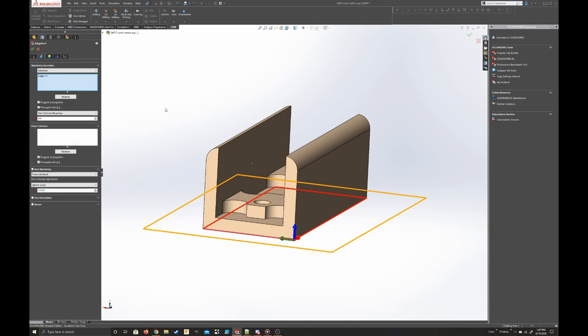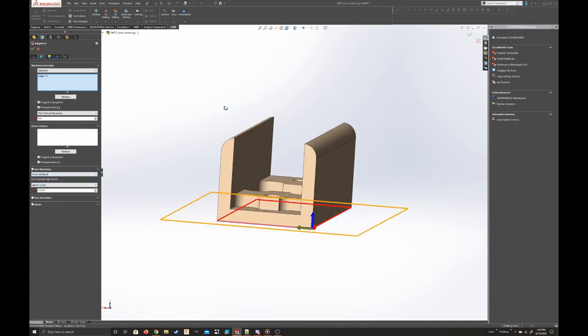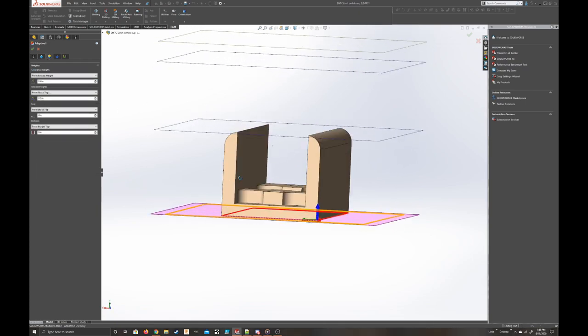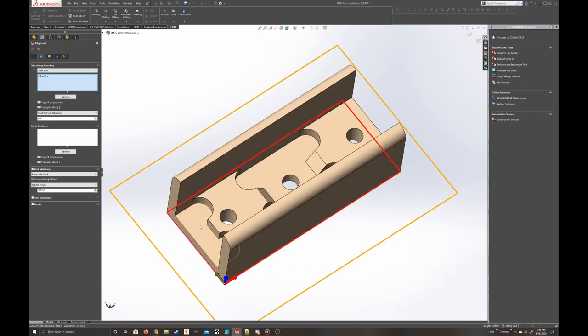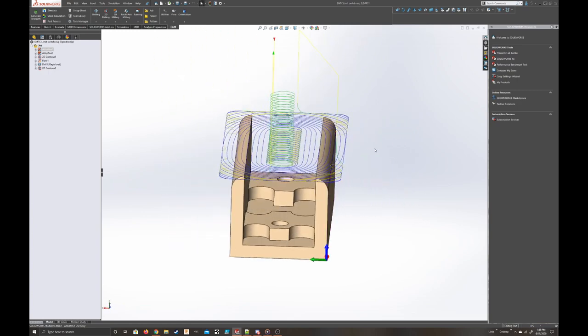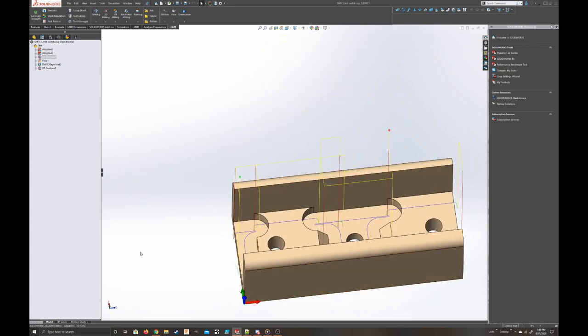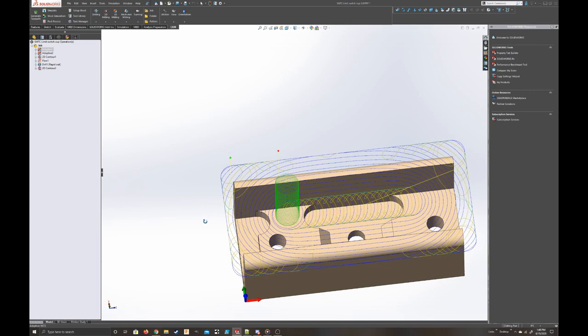In the geometry tab, I just specified the outside edge of the part, tool outside boundary, and rest machining turned on, from job stock, because there's nothing else that I have. The heights tab is the most important part here. It machines only from here to there. It only machines away the top part of the material, and since it is tool outside this boundary, it will machine everything just about like this. I'm doing this so I can see the part more easily when I'm machining it, and also so that some toolpaths, like this contour coming up, don't go too far inside and cause a big bad with the end mill, let's just say.